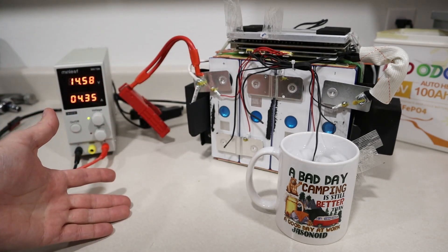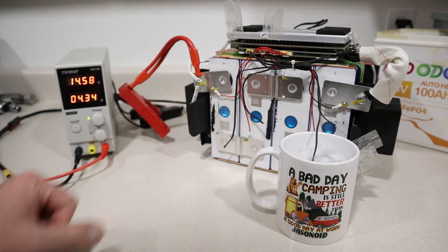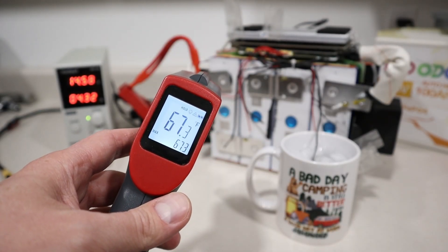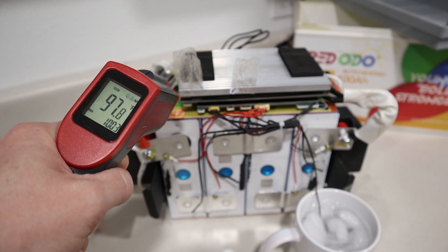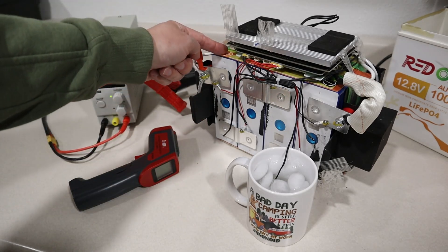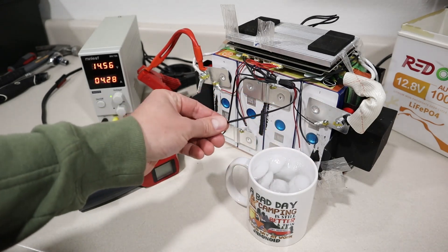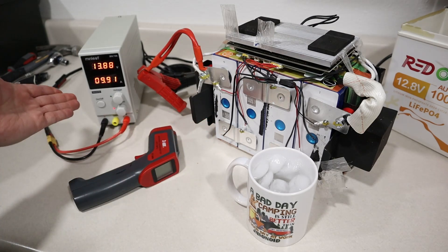I'm going to give it about 10 to 15 minutes and I want to see how hot the heating pads get with my temperature gun to see if the battery is starting to warm up. When I started this test, the heating pads were around 67 degrees Fahrenheit. After about 10 minutes, we're sitting right around 100 degrees — pretty impressive, they are definitely warming up. After testing both the low temperature charging protection and the heating pads, everything appears to be working properly. If we take the sensor out and warm it up, we should start seeing it charge at 10 amps — and there we go.